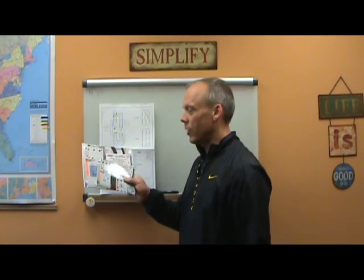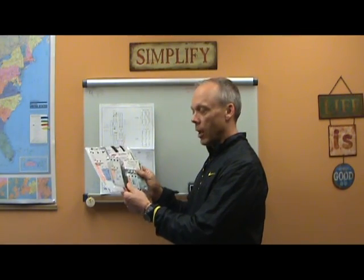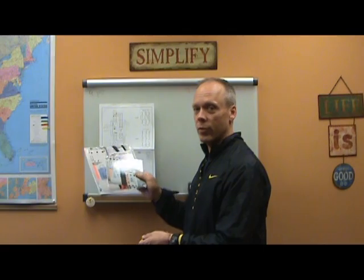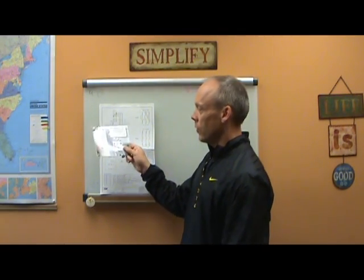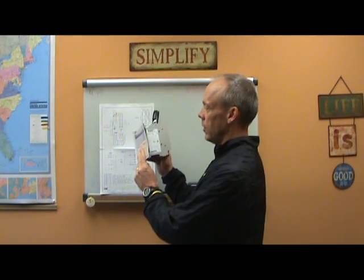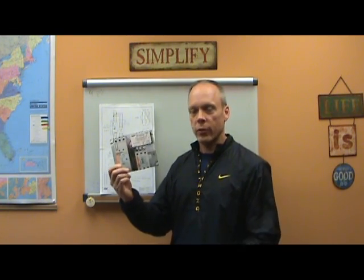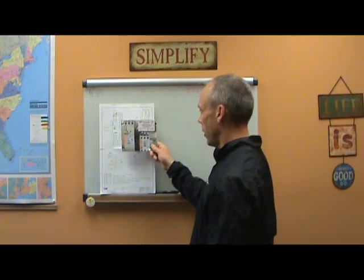If you're wondering how you can tell if it's going to fit or not, here's something that we've done with Sprecher Schuh — it's got our name on it, vertatron.com, right here on the back. This is something that we give out; you just give us a call and we'll send one to you. This is the actual frame size for the smaller frame unit — you can see it fits right up, it's the exact footprint of that unit. It tells you right on the front that this is good for 208 volt up to 20 horsepower, 480 volt up to 40 horsepower. So if you're a technician or a sales guy in the field, you can walk up to the control cabinet and say: is that going to fit, do I have enough clearance, is that going to work?